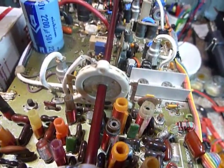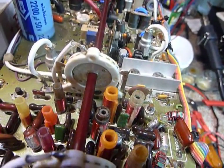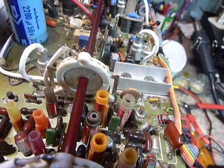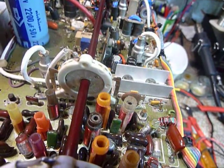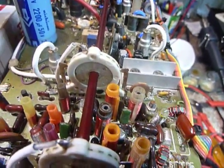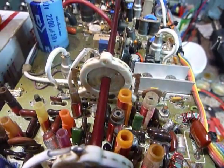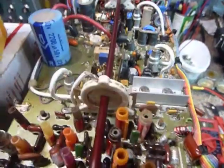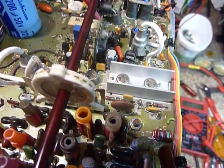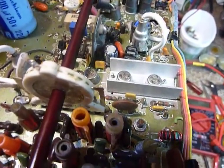That's how to check those transistors, and it's a technique you can use on basically any bipolar transistor - 2N3904 or anything like that, little ones, big ones. A lot of times you can check them right on top of the chassis. The only time you run into trouble is if there's a transformer or something connected between two of those leads. In that case you may have to start taking things apart, but in ninety percent of cases you can check them right on the board.